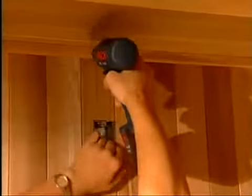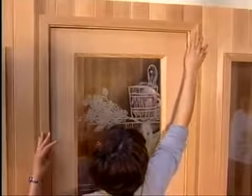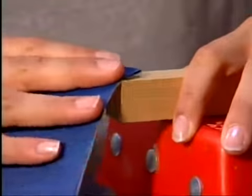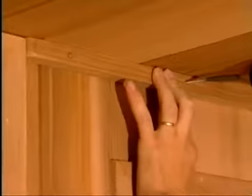Do not install the front ceiling moldings at this time. The door is designed so that it can be properly aligned easily. The door is properly aligned when the space between the door and the door frame is equal on all sides. Once it is in position, the front ceiling moldings will keep the door in place. Measure and cut the ceiling moldings on either side of the door. Sand the exposed molding where it butts into the door casing for a clean look and install.